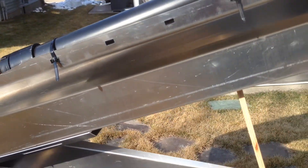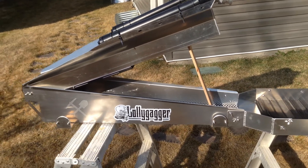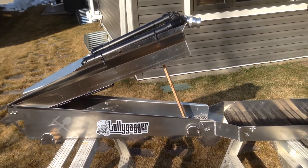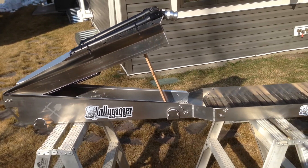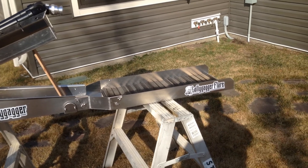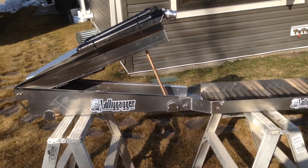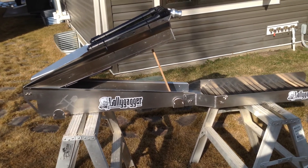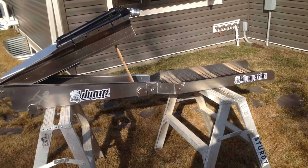The unit itself came together pretty nicely — I'm quite happy with it. Nice clean lines on the fabrication. The top hopper is made out of 0.1 aluminum and the bottom main sluice and extension are made at 0.08. I really like good quality stuff and good workmanship, and I just hope that this unit reflects that.